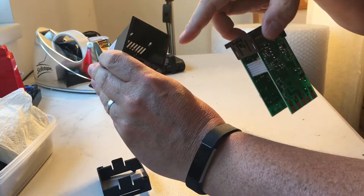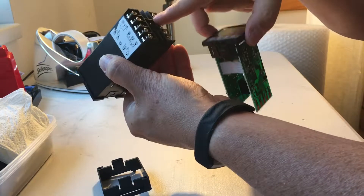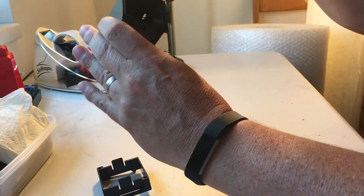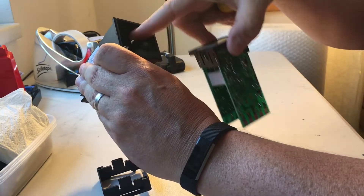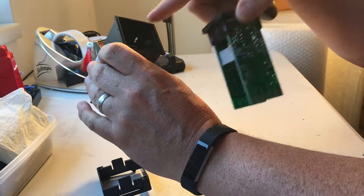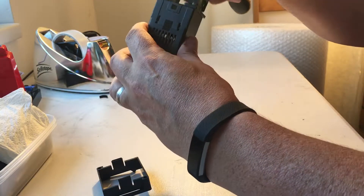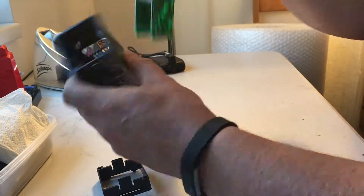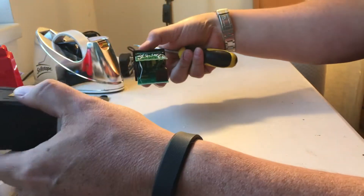Inside at the bottom there are some small spring-mounted clips which provide the power interface between the terminals on the back and the PCB inside. On the higher voltage ones particularly, you can get corrosion or arcing between them, causing intermittent connections. You can normally spot a problem by jiggling the front when it's in situ, as the power will come and go.